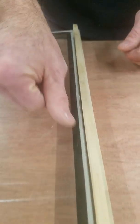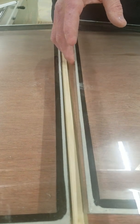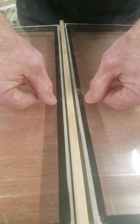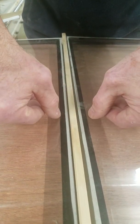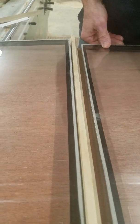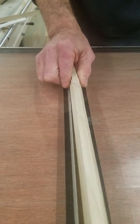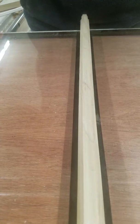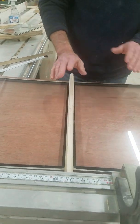At the factories, they don't always get those perfect, so there's some variation you've got to account for. When you put these two together, what we have here between the spacers is at least an inch, plus 3/8ths — so 1 and 3/8ths, sometimes 1 and 1/4 inches. And this is where the problem really lies: when you're looking at it from the inside, or after you get it glazed, you've got a quarter inch or 3/8ths of spacer sticking out into your sight line. You don't want to see that — you've got to bury it if it's going to be right.